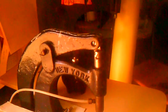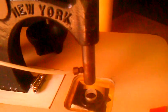And what you see is a lever that comes across the top and past a hinge, and then it goes down and through the table. If you continue following it under the table, it comes over and terminates at a pedal. That pedal, when you kick it, puts force up that arm, through the hinge and then down the ram. So that's what makes the force. Instead of using a hammer, you're using leverage to smash things.